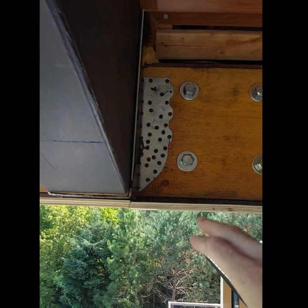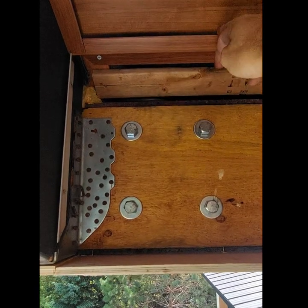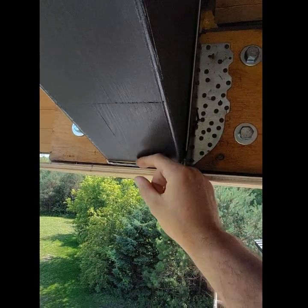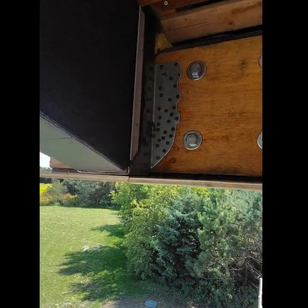I have a different height here — I think it's an inch higher than this side — because on this section we've got the extra strapping and lighting for the LED track. So there are two different heights. Instead of bending, since it's only three-quarter inch on the bottom, I'll do another piece that's 16 inches wide and the joint will be so small and minimal it won't show underneath.